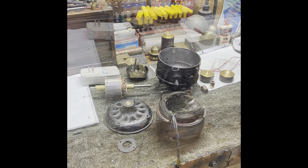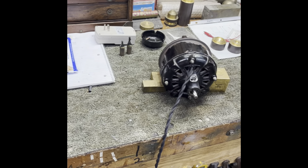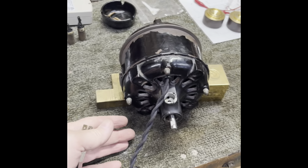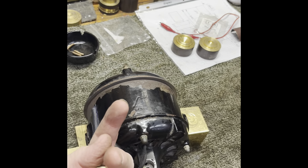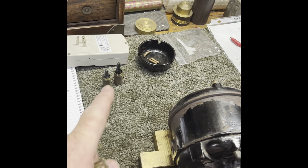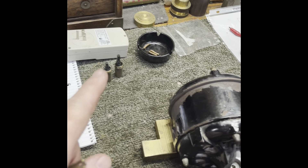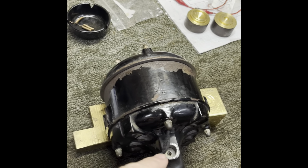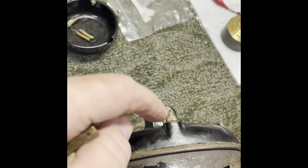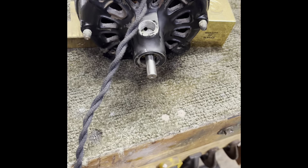The Westinghouse tank motor is all back together. I've got the motor actually turned upside down right now because the oil cups aren't in it — I want to address that in a separate video. With it upside down I can put a couple of drops of oil where the oil cups go just so we can get lubrication to the bearing. I've got it hooked up to a test lead — I'm going to plug it in and let you see it start up and run.